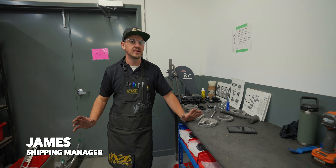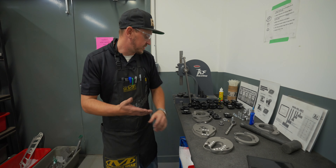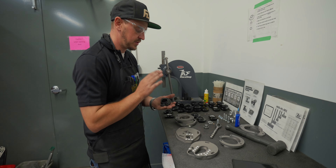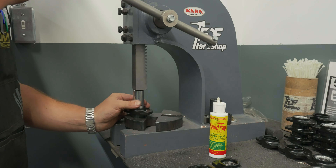We're trying to find a little bit of efficiency when it comes to our caster plate assembly. Right now the process is basically taking our billet caster plate bearing mounts, pressing our caster plate bearings into them, then using our lock rings to tighten them down to 35 foot pounds, and then assembling them into our caster plates. It's not the least efficient thing in the world but it can certainly use a little bit of tweaking. Right now the whole process takes about a minute each - every minute we can save means we can get something out to you guys a little bit quicker.